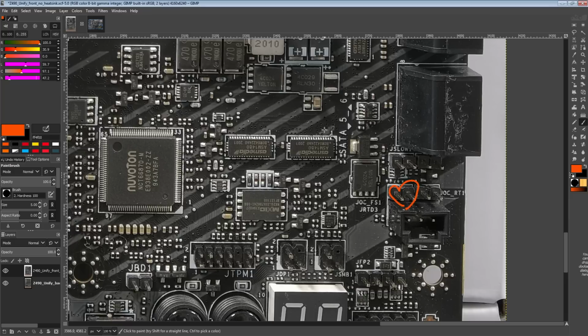Now, if you're bad at keeping track of profiles, that's not really an option, right? You're going to be redoing your settings over and over again. Alternatively, sometimes you run into issues with boards not properly saving profiles, which the Unify has been misbehaving for me with. I've had the board straight up erase all my profiles at one point. So yeah, that's not been great. But even if you're on top of saving profiles, clear CMOS and load profile takes far longer to do than safe boot or fail set does.